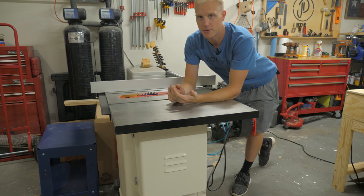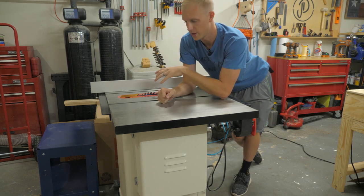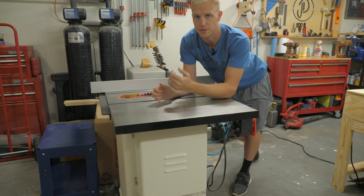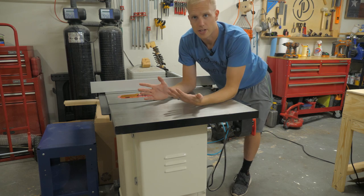Anyway, it's the same one that we've had, but it can switch. You can change the motor wiring to go from 120 to 240. It's currently wired to 240, but if the landlord here wouldn't allow us to put in a 240 plug, okay, fine. We could have just rewired the motor, and that's specifically why we went with this model. Yeah, I really like this saw.